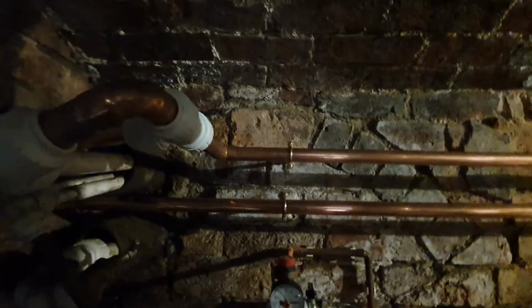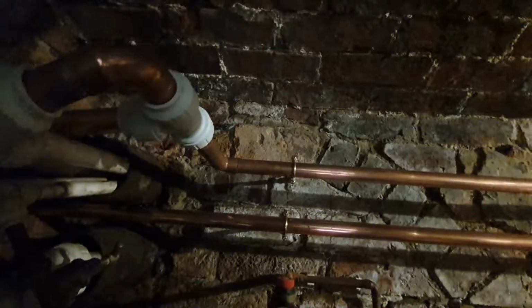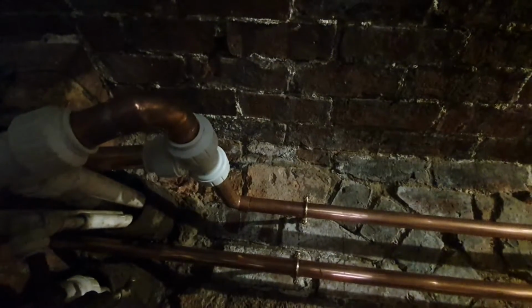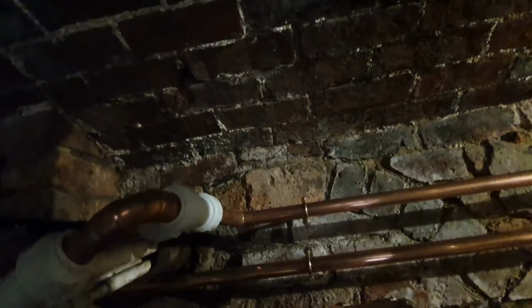these were the flows. I've made them the return now. It really doesn't make any difference. They're all bi-directional radiator valves. It's actually a new system they've had put in. I don't know why they've put these in 28. They're massively oversized. Everything was massively oversized on this job. Basically, each one of these is only feeding 4 to 5 radiators each. So 22 would have been absolutely ample. But it is what it is.